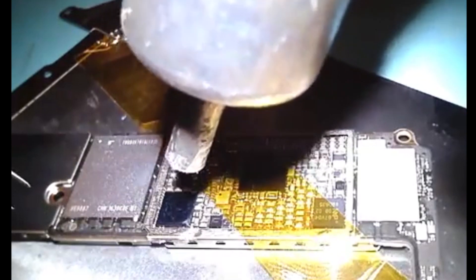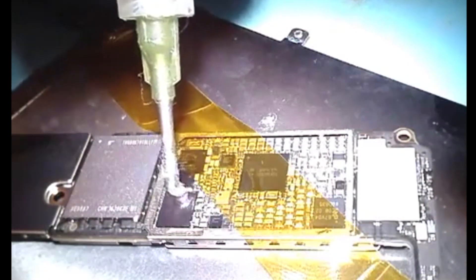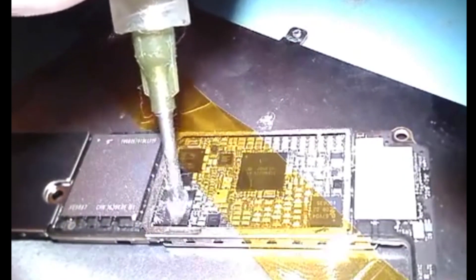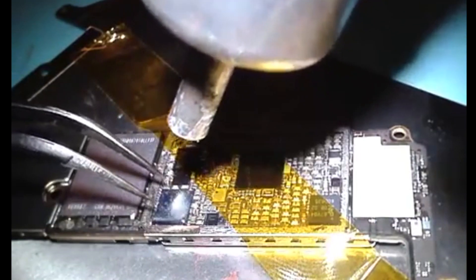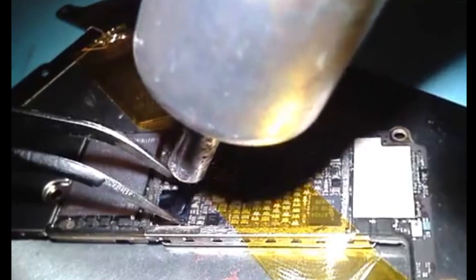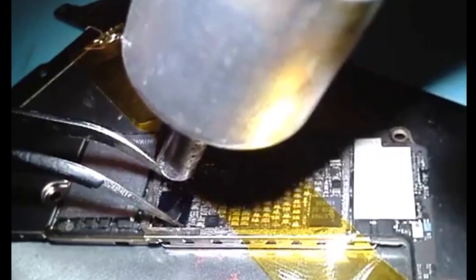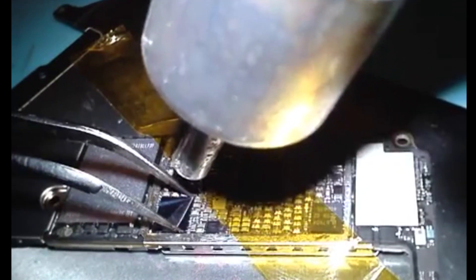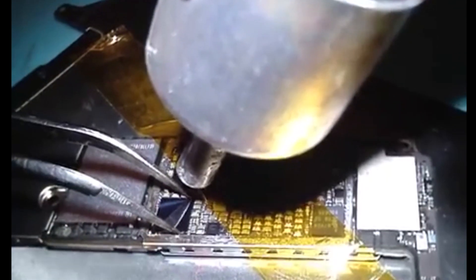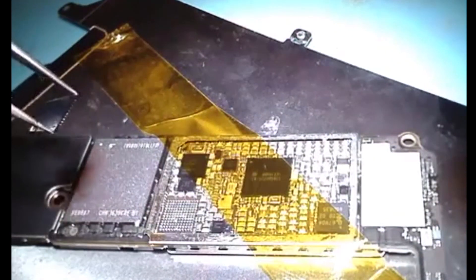So now we're going to come in with that hot air gun at 350 degrees Celsius. I have my tweezers ready — this is a very quick process. Once you start heating it up, that flux is going to boil away. I'm going to add a little bit more just to compensate for that. This needs to be under flux the entire time — that's just going to give you nice, clean solder on both the chip and the solder balls. Now we're going to begin to heat it up slowly. These boards heat up fairly rapidly with the exception of this chip — it has a lot of ground points under it and therefore a lot of thermal mass, so it just takes a lot of heat to get it off. You're just going to be patient and have a steady hand with it. There's not a lot of room for error, and you'll see that I slip while trying to pull this thing up, and then it comes off all in one piece.